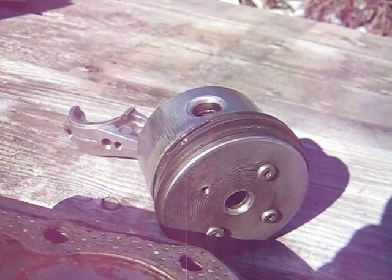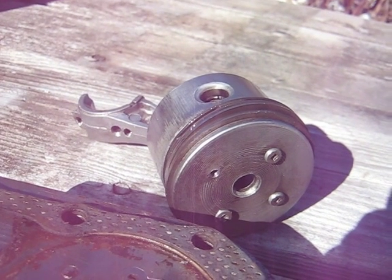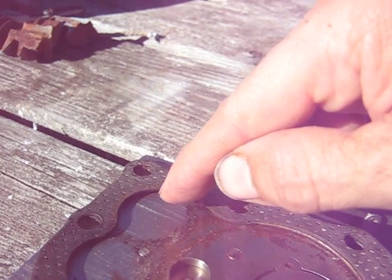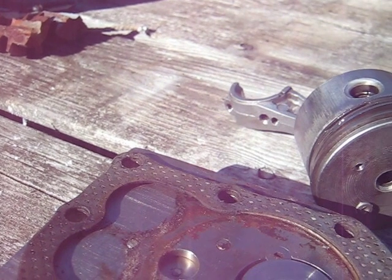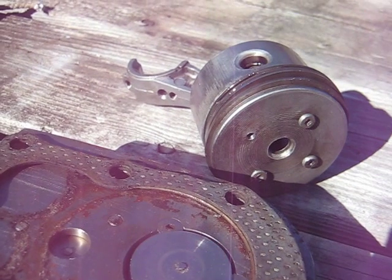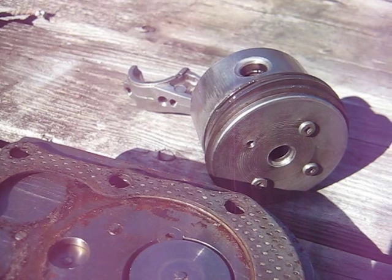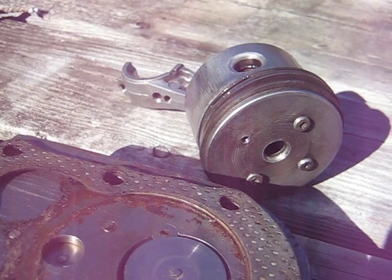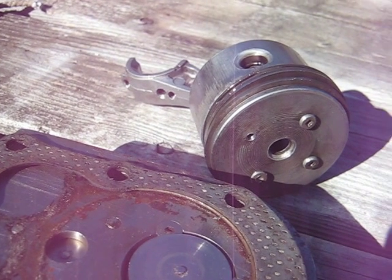Because it's not going to be spinning 3600 RPM — mine runs at about 600 RPM. You'll also want to fill this whole area here with high-temperature silicone seal, because you want to minimize the volume in the combustion chamber — otherwise your compressor won't put out very much air, especially at higher pressures. So every little bit that you can fill in above the piston will help.